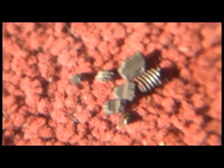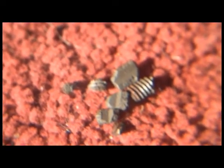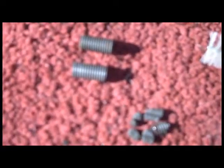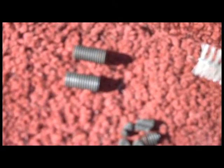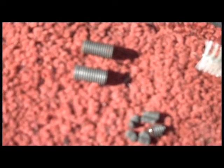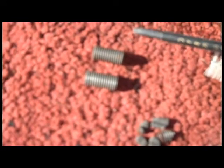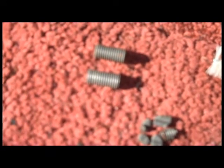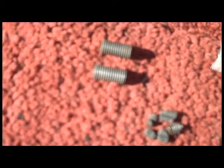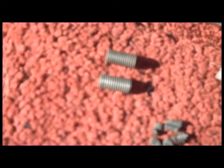The core is out and here's what's left of it — not much. I had to break it up with a small screwdriver; it was cracked all the way through. Now I need to clean this out and find a core that will fit, similar in length. Here's a replacement core I pulled out of another old chassis I was saving — pulled it out of one of the other transformers to match up an approximate size. This is our new core, and I need to put it back in the cabinet and tune these coils to see how the band pass looks.